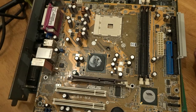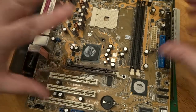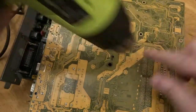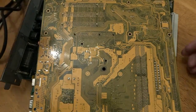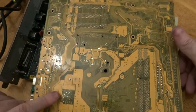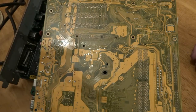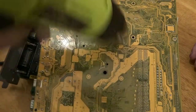Safety is the main thing, always remember that. Since I'm doing this outside it may be hard to hear me over the heat gun, so let me explain the technique: I'll use a bucket, place the board on top of it, then use the heat gun to heat the solder. Once the solder is up to temperature I just tap the board and the bits fall straight down into the bucket.